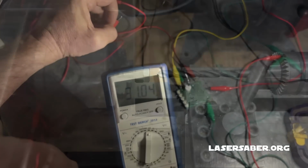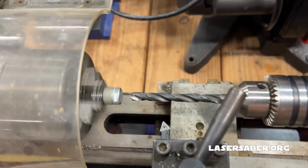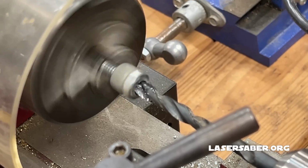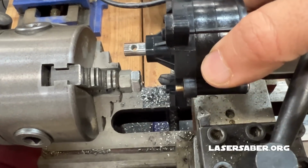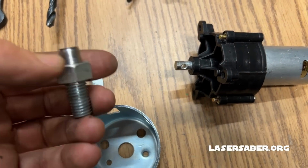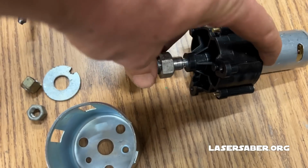I ordered another 1,000 of those transistors, and I definitely did see the effect again. The voltage would bounce up as high as 41 volts after removing the power supply from the electrolytic capacitors. Overall, the voltage would still go down, but it would bounce around a lot. It would drop back down to 31 volts, bounce up to 36, drop down to 27, bounce up to 28.